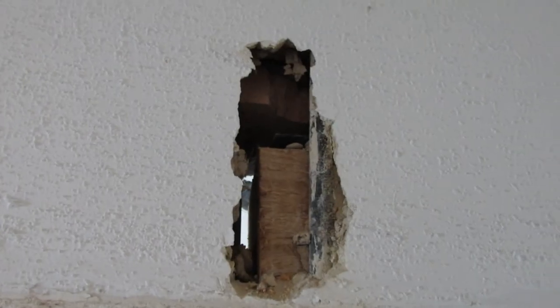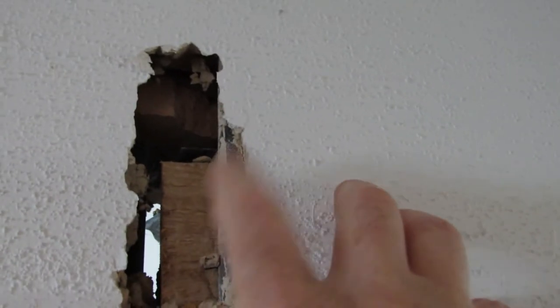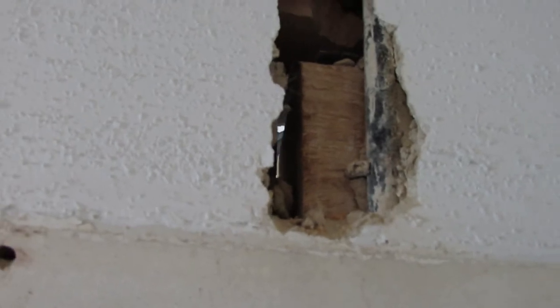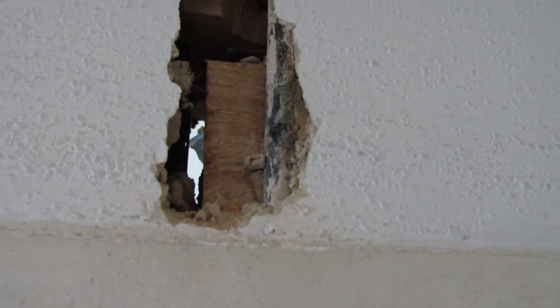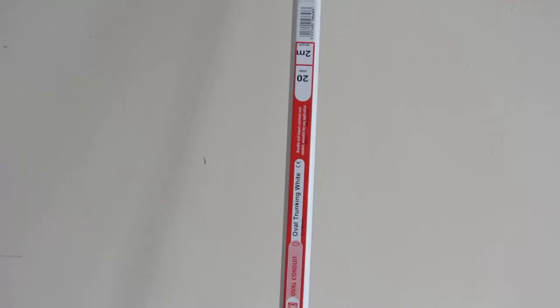What you see here is the old fashioned way of getting cables down the wall: a little piece of pipe, metal pipe — probably copper, but steel more likely — and the cable goes down through it. So when you hammer into the wall or nail into the wall, you hit the bit of copper before you hit the cabling. And here we have the modern way of doing it: a piece of plastic trunking.